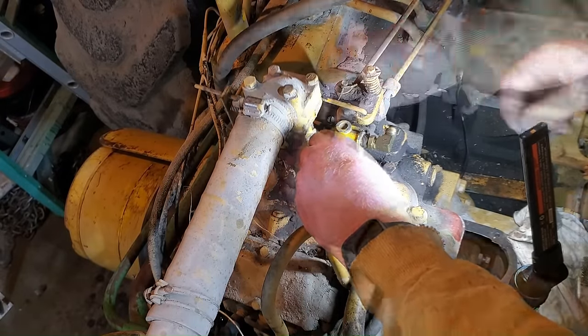Okay, I went ahead and cut out all of the old wiring that was already in here because I thought it was a little bit suspect and I didn't trust it. And I've just rewired everything following the wiring diagram from the John Deere manual. I've put it in place here, just connecting the starter switch right here. I disconnected everything for the ammeter, for the fuel gauge and the fuel starting switch, and all the lights. Disconnected all of that, and now we're just gonna be running power into the distributor through the switch.